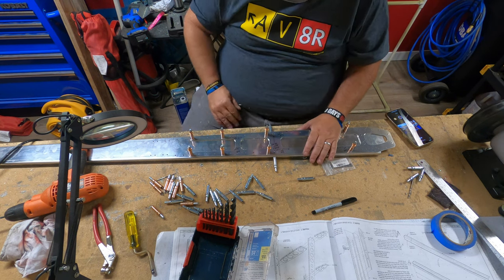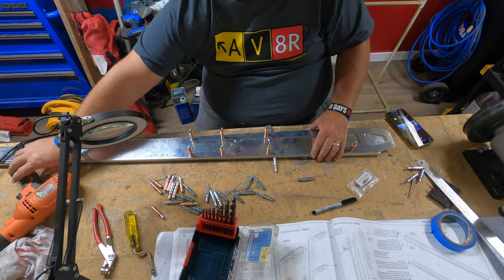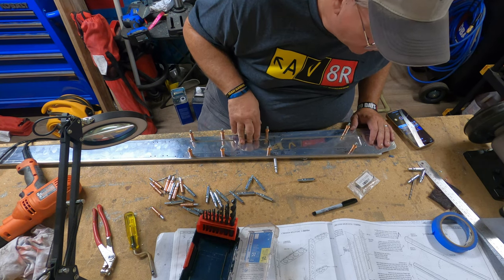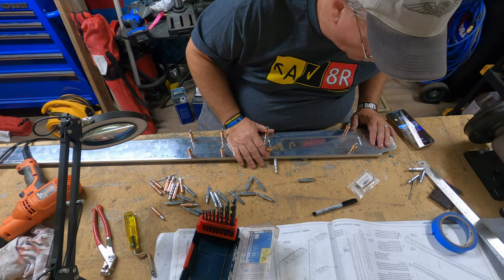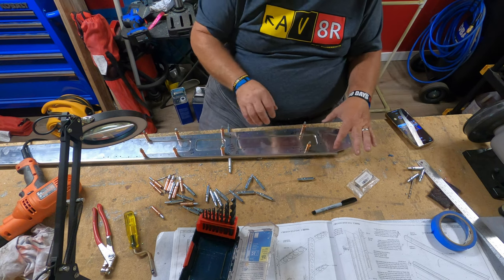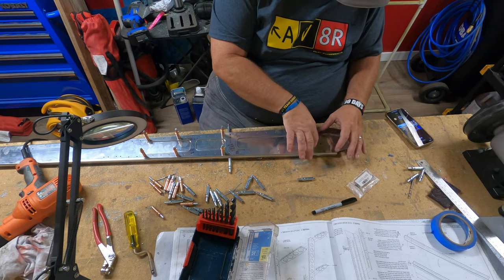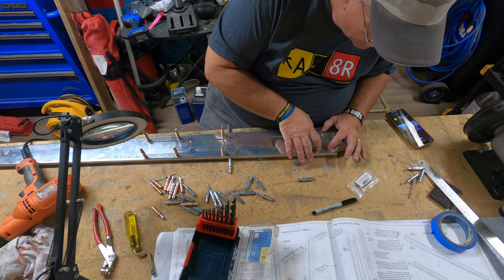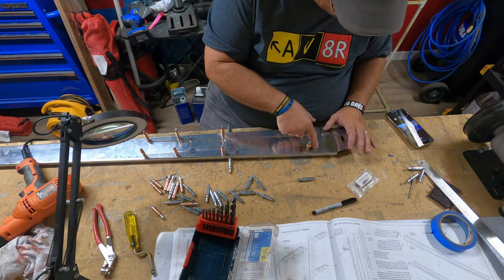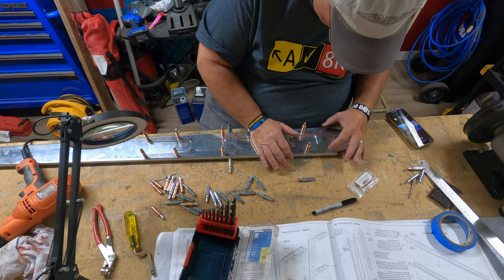So, okay. There's some steps that you won't do, that they want you to do, but not yet. So, we'll get that. Step 5, which is the final size drill number 9, final drill number 19, the 4 holes common to the bottom rudder hinge bracket. So that is these 4? Yeah, 1, 2, 3, 4. Yes. Bottom rudder hinge bracket. Or is it these 4?